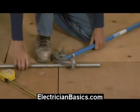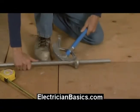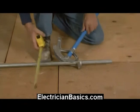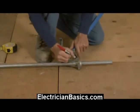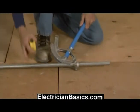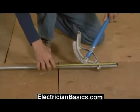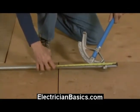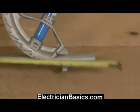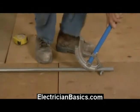Another trick you can do is without even marking the pipe. Take your bender — this is one I like a lot. Place the conduit in the bender just a little bit loose. We wanted a ten-inch ninety, so we know we have to mark the pipe at four inches and place it at the arrow. I'll mark the arrow of my bender with a red marker. Then, with the pipe not too tight, I take my tape and slide it until the arrow gets to four inches — same as deducting six inches and having it at ten — and I didn't have to mark the pipe.